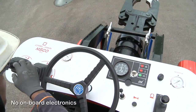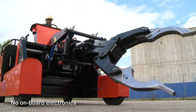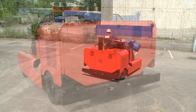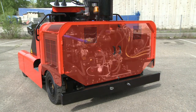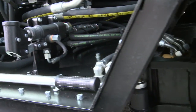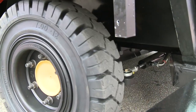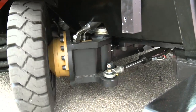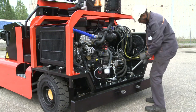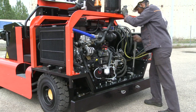For maximum reliability, this truck operates without any electronic equipment, a major source of breakdowns. The vehicle motion and the hydraulic pump are both powered by an internal combustion engine. Drive transmission is by a motor attached to each of the solid tyre rear wheels. The steering axle is fitted with two hydraulic rams. If ever the handling truck is immobilised by a failure in the engine or the hydraulic pump, the standby hand pump can be used to release the hydrostatic brakes and allow the truck to move.